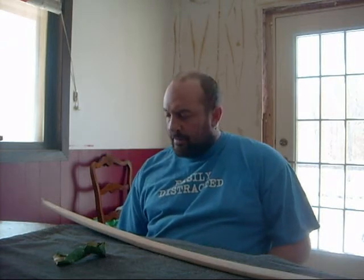What I just learned on Paleo Planet when I asked a question was that the best thing to do with the glue is to thin it with water. And I've never done that before. I've never used hide glue, but I've used other glues and never thinned it when I back bows with rawhide. Now I used hide glue because this is my first sinew back bow and it's supposed to work best with it. But it makes sense to me that if I thin it, it'll penetrate the wood better. And I'll give it, like I said, a couple, 3, 4 coats to make sure the penetration's complete.